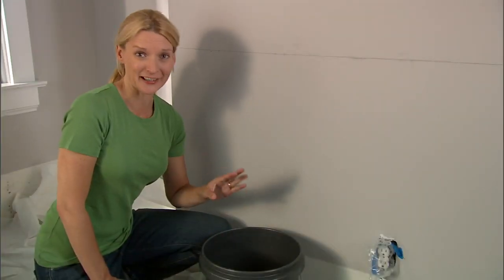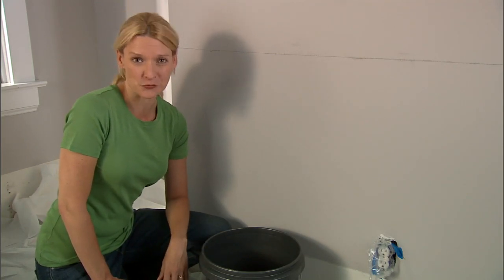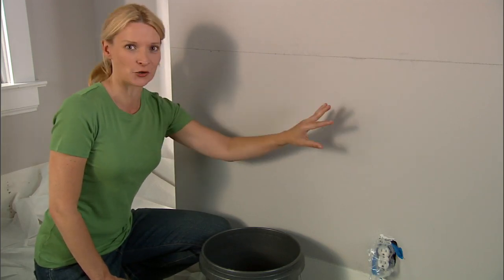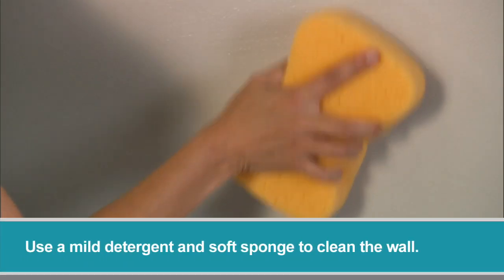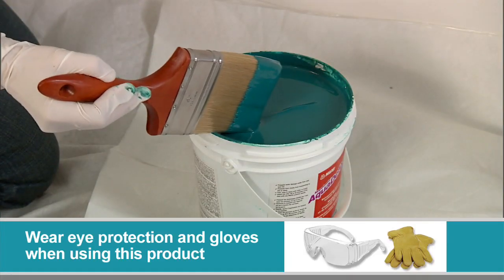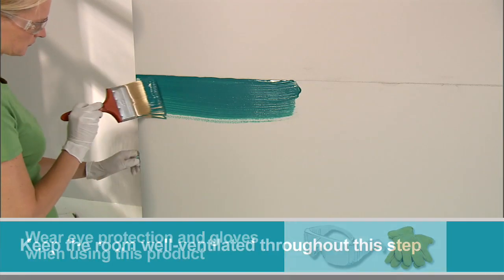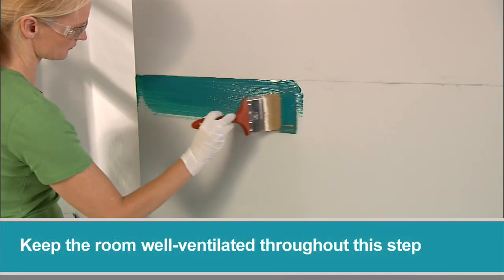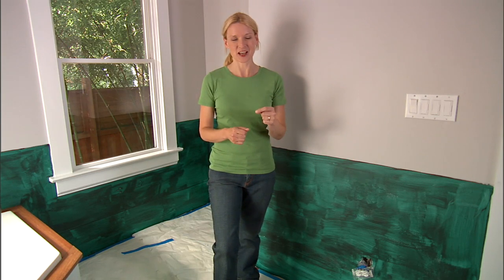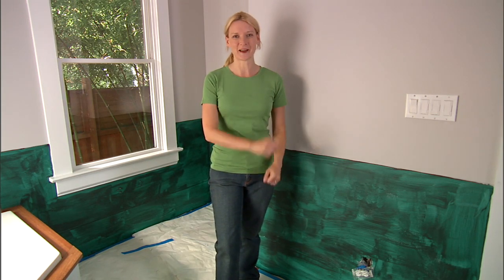Your best option for a backing surface if you're starting from scratch is moisture resistant wall board. But if you're starting with a painted wall like we are here, you'll want to add a waterproof sealant over it. First, clean your wall thoroughly and then dry it. Then using your brush, apply your waterproof sealant from top to bottom. Make sure you're in a well ventilated room when you work with this sealant. Apply two full coats and make sure it dries completely before you move on. Prepping the wall can take some time but it's crucial for the success of your project, so take your time and do it right.